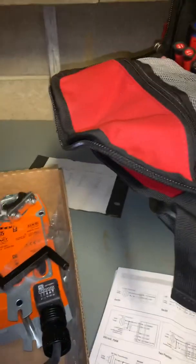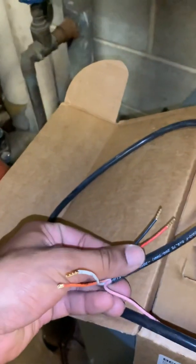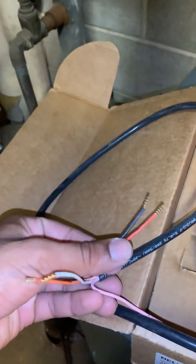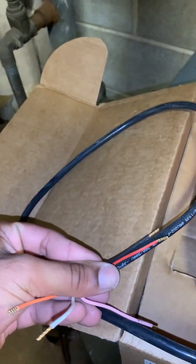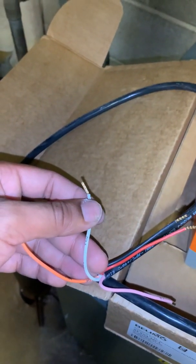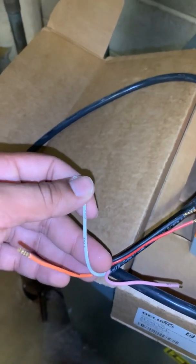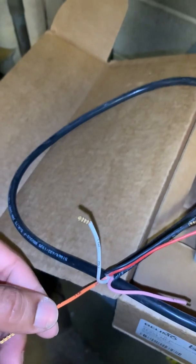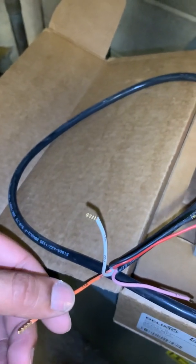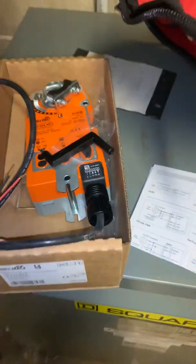So to repeat: these are my two wires coming out of the transformer, or whatever you get for your 24 volts. White is my output signal from the controller to this actuator, and orange to green, which is my feedback coming from the actuator back to the controller.